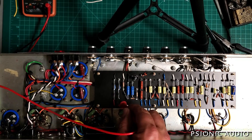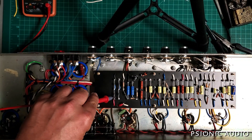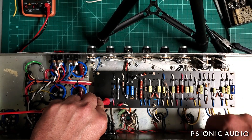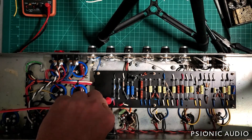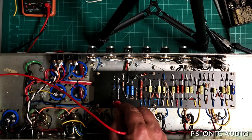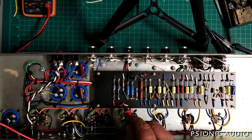It takes a while for it to stabilize. With the current limiter, it's stabilizing at about 470V. I'm briefly turning off the current limiter to see what the voltage goes to — we've got 120V coming from the mains. I want to make sure I don't exceed 500V unloaded, because the caps in the phase inverter and preamp can only handle 500V. The caps in the reservoir and screen nodes can handle 1000V. With the limiter off, it's not jumping a huge amount — that's good. The unloaded B+ is about 474V, which is pretty much in line with what I expected for a mid-70s Marshall 100-watt.